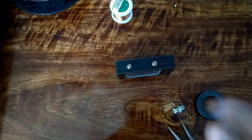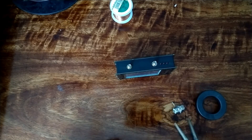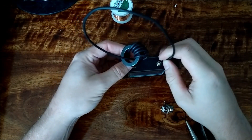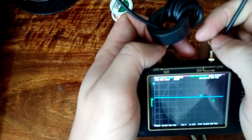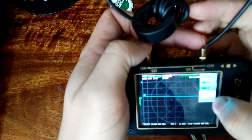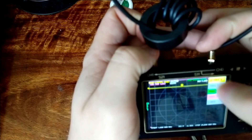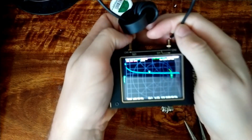That's two, three, four, five, six - definitely didn't do that very evenly, but it's alright. We'll try to stick one of these in the end of the SMA connector. We're still in the upper half of HF. You'll see that the choking impedance is exactly the same, so it doesn't matter what wire you use. I'll recall slot one - I was looking at 7 MHz before and had about 20 dB. So the wire you use to wind a transformer does not matter.